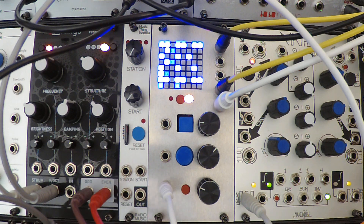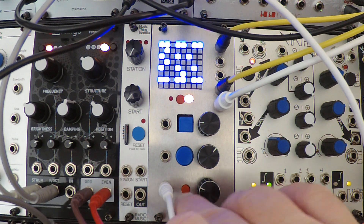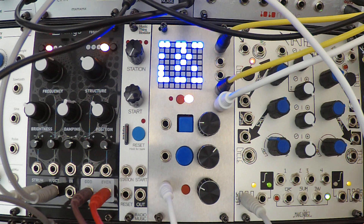These are the changes I've made. This is my first full paneled-up Eurorack version, implemented in a two-board PCB set — it's all through-hole. There were several errors I made in transcribing Craig's schematic, resulting in a few green wires to the circuit as well as green wires to implement some of the new features. I'm planning a second revision of the PCB set. I did the through-hole design to make it easier for other builders to build these modules.